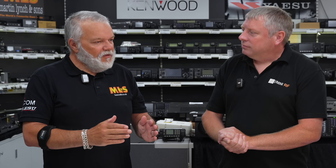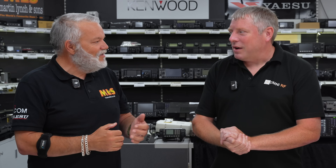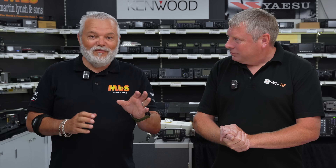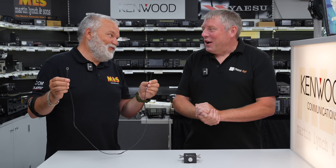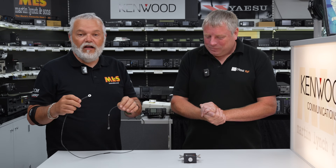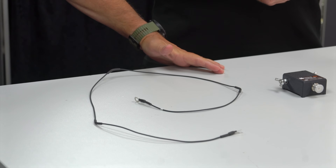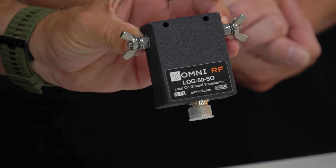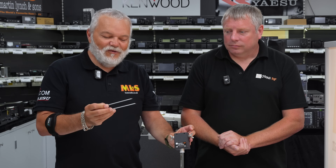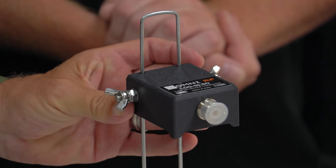It's almost grabbing out the wanted signal rather than the unwanted signals we experience at home — coming from all our little wall warts and chargers and whatnot. Amazing. So I know you brought something special for us to demonstrate it. This is a shortened version — a lot shorter. Normally 60 feet or 100 feet they're available in, but this is what the loop would look like on the ground. You might see here that we've got a couple of holes which just so happen to be the same diameter as a peg, so you can pop that through the holes and peg this down to the ground.